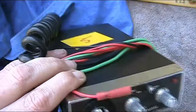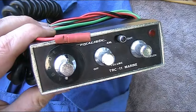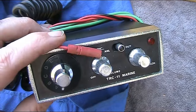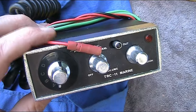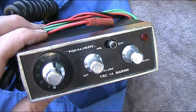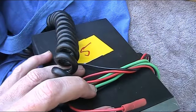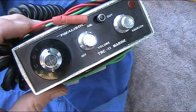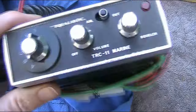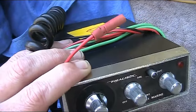With 10 meters becoming open it could be useful as a novelty little transceiver — just a few watts of AM on 28 megahertz, possibly, if I've got the right crystals. Normally these require two crystals, one for transmit and one for receive, separated by about 455 kilohertz. If you're smart you might be able to add a DDS VFO for more frequency agility. If I didn't have crystals I probably wouldn't have purchased this rig, but I do, so it could be a fun little project.